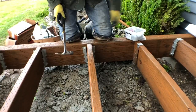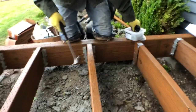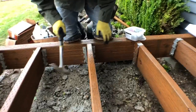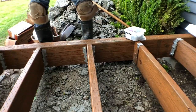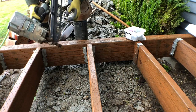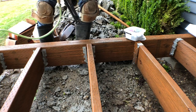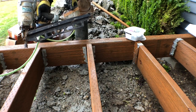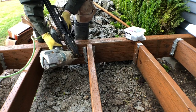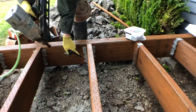Three of the 10-penny nails and on the other side the 16D. Now a lot of times people like to hand-drive the 16Ds in the sides — I don't do that if I have a nail gun nearby. What I have is this Hitachi, just a standard framing nailer, and I'm loaded with the 16D nails. I just set my nail gun right up against the hole and the nail will just guide its way in.